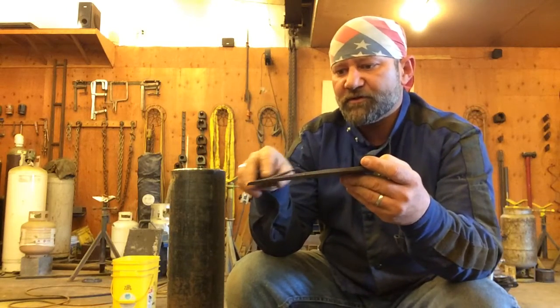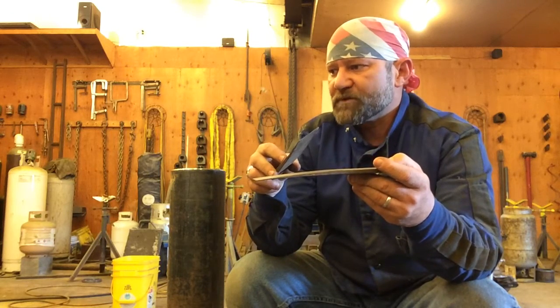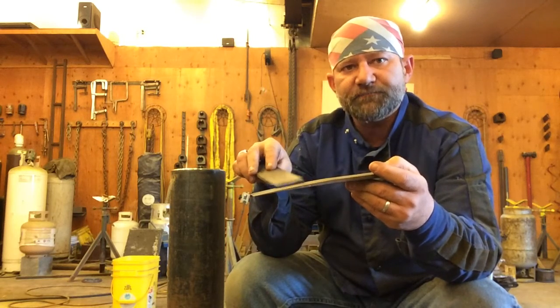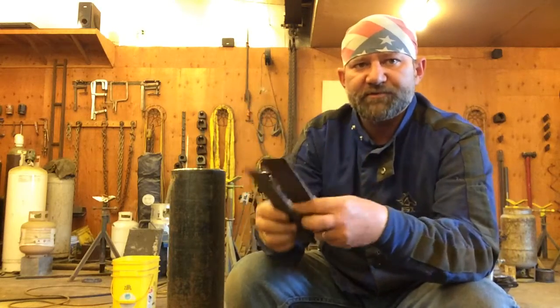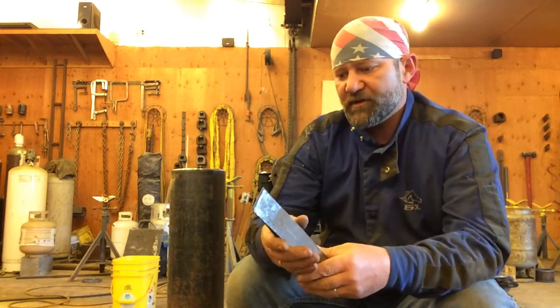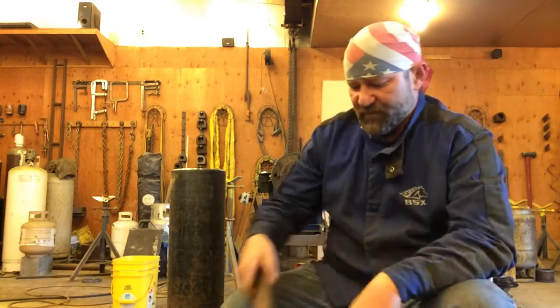And one note on shaping these, if you make them homemade, you could use a leaf spring, maybe an old chisel or some kind of tool steel, something you found, as long as it's hard metal. When you're shaping it and grinding it, you might want to grind a little and then cool it with water, and then grind a little and cool it with water, because with this hardened, tempered steel, if you just go grinding to beat the band and get this thing hotter than the hubs of Hades, then you're going to take the temper out of it, and then it won't be hard no more, and that's undesirable. So anyway, fit up, spacing wedges are a good thing to have.